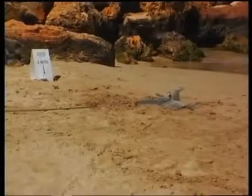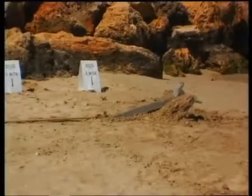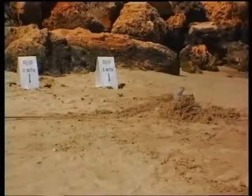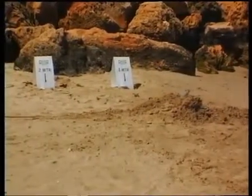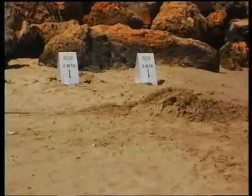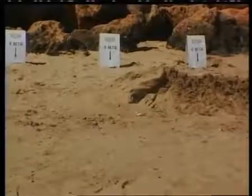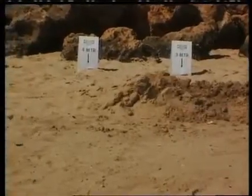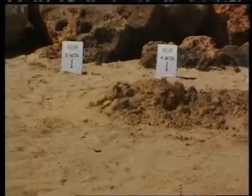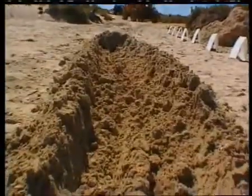The first anchor tested was the 28 kilogram Danforth. As the load is applied, the anchor drags for a while with only a small resistance. Then, after 1 metre, the anchor stands up on its toes to begin the burial process. The holding power has reached 140 kilograms and by 2 metres has reached 420 kilograms. After 3 metres, the load is increased to 550 kilos and the maximum of 570 kilos is reached after 4.5 metres. The anchor, however, becomes unstable and rolls out. There is considerable disturbance to the soil and no real penetration has occurred.